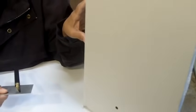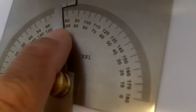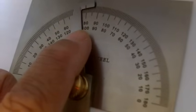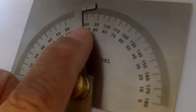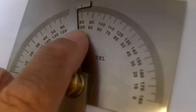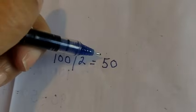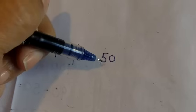But what happens when your angle is larger than 90? They call that obtuse — an obtuse angle. There's a formula for it. Our angle is 100 degrees — that's our measurement, our outside corner is 100 degrees. Remember, obtuse means larger than 90. Now there's a number shown alongside that — it's 80 — and I'll explain that in the formula. But for now, remember that our outside corner measures 100 degrees. So what we're going to do is divide that 100 by 2, which equals 50. Here's the problem: it's obtuse, that 100 is obtuse, and even though we've divided it by 2 to get 50, we can't set the miter saw to 50.